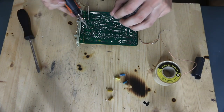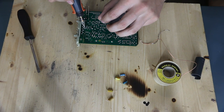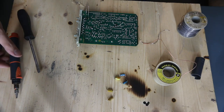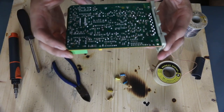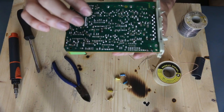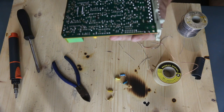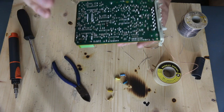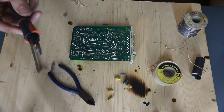Now we'll solder these in. And there we have it — let's clip all these leads off so that it looks nice and tidy. There we have our capacitors replaced. Now, the other thing that tends to plague these is that over the years, some of the solder joints from the vibration, heat, and cold cycles will degrade or crack. So we're going to run over with our soldering iron and just touch each of these to melt the solder, so that if there was a bad connection there, we can refresh that connection and make it like it was when it was new.